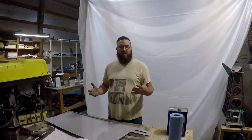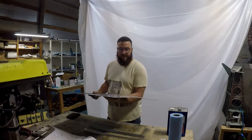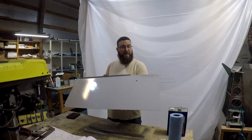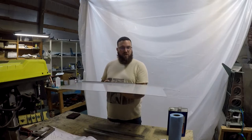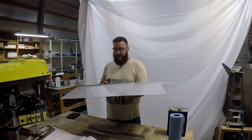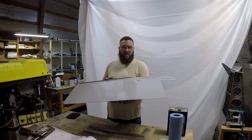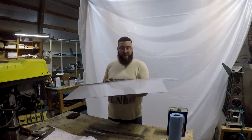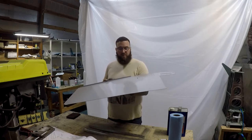I just want to go over some of the results. I'm being careful because it's not fully dry yet, but this is what I sprayed earlier — it's got three coats on it. It has quite a bit of orange peel if you look at it close in the light. But again, this is one of the footwells and it's the interior, so I'm not all that worried about it. I don't need a gloss finish on the interior — I just want something that's going to protect it and not scratch off with normal wear and tear, and I hope this will meet that.